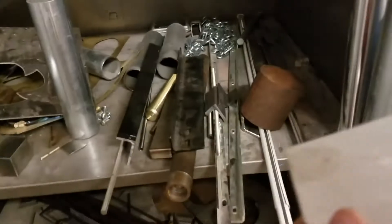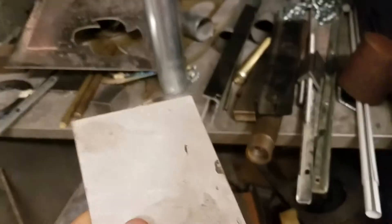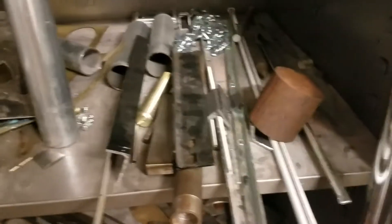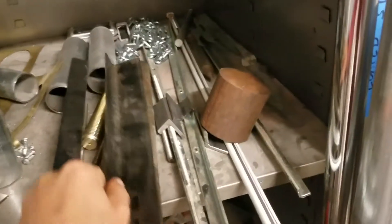Aluminum is also very soft, and you can't use it on a bunch of the tools — on any of the grinders it will just melt. Brass has that distinctive brass color, fairly easy to tell apart from copper if you compare them side by side. Coated steels are steel with paint so they don't rust. Uncoated steels, as you can see, get kind of rusty.